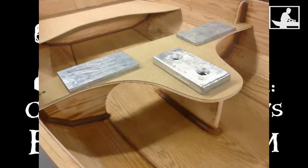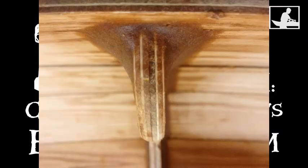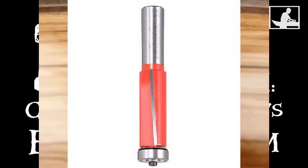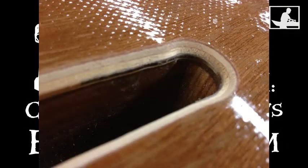Once all the machining is done, a thick bead of epoxy goes down on all the mating edges, and the thwart is lowered into place for the last time. Weights hold it down while it cures overnight. Now all the fillets can be made — the large radius means a lot of bonding surface area to make the boat super strong. The scariest part of the entire build for me was cutting the hole in the bottom of the boat for the daggerboard. I used a drill bit extension to drill down through the daggerboard slot to exactly locate the position, then used a jigsaw to connect the dots, followed up by the flush trim bit in the router so that the slot perfectly matches the inside of the case. I then eased the edges to prepare for waterproofing the exposed plywood laminations. If this one step isn't done perfectly, then the only thing the boat will be good for will be a Viking funeral.